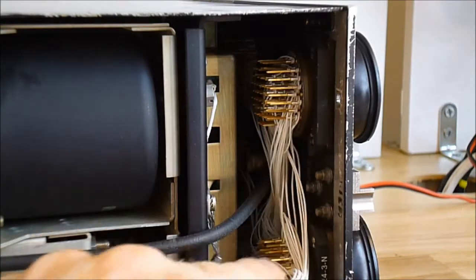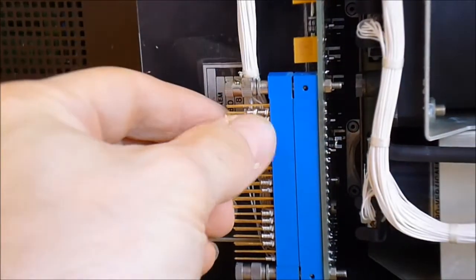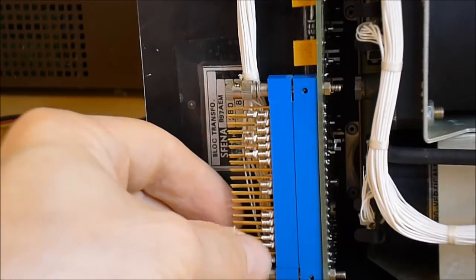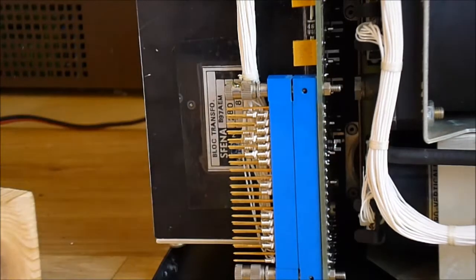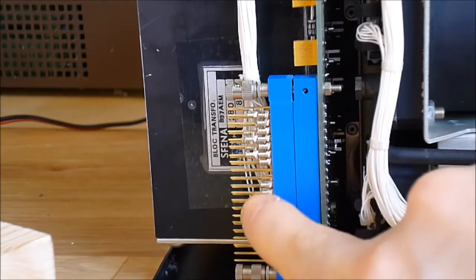So let's zoom onto the wire wrapping. You see all these connector plugs are connected with wire wrapping. It is not soldered. Maybe you have a better look here. It is a quite old technique to make connections. It is quite efficient because the wires are very well held in place without using solder. Maybe this was more eco-friendly than solder and than putting crappy unleaded solder as they do now in electronics. I think it was much more reliable and efficient, but you do not see this anymore. At the time all backplanes for computers were made like this.